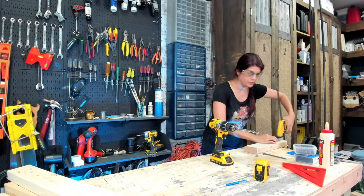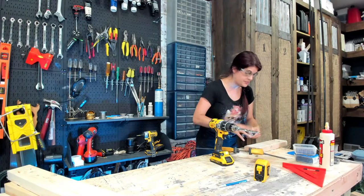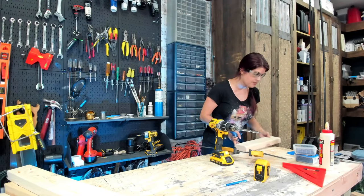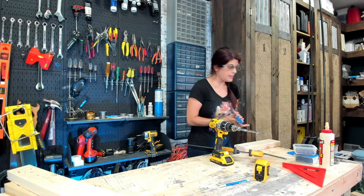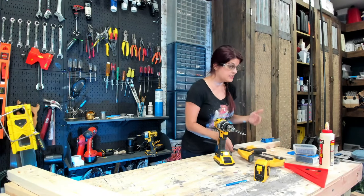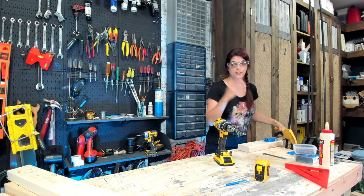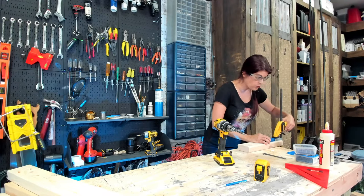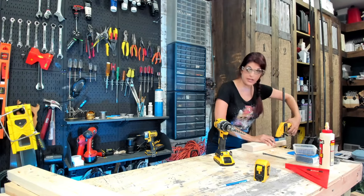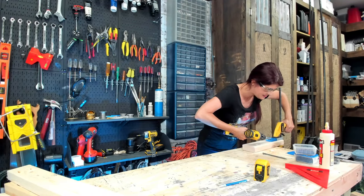So this workbench was built entirely, I believe, with the Phillips head style. And there's a lot of slipping and stripping. The only one I could find that I could get in time was the Torx head one, so I was like, fine, I'll use those. So much easier. They went in, obviously with a pilot hole, just like butter, way more than a Phillips. So there must be some kind of physics lesson in there, and now I'm super curious. I'll have to look into why that is.